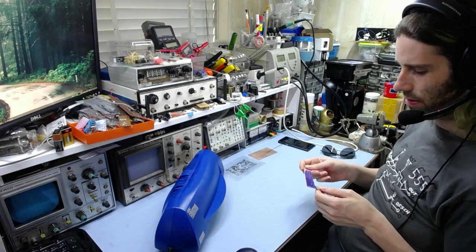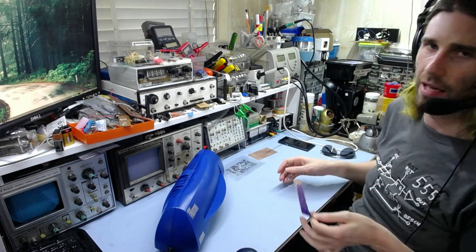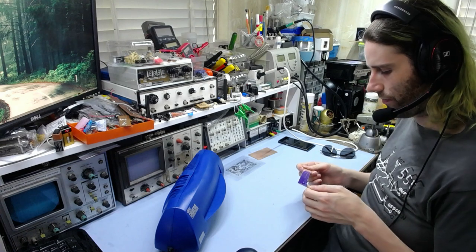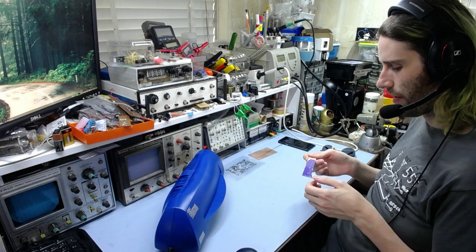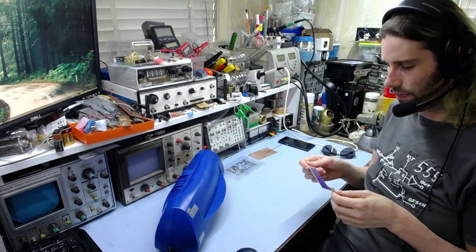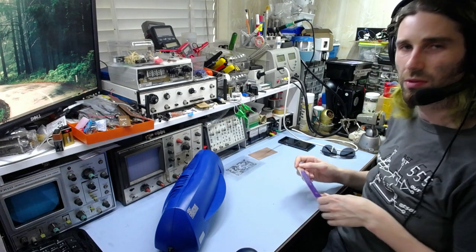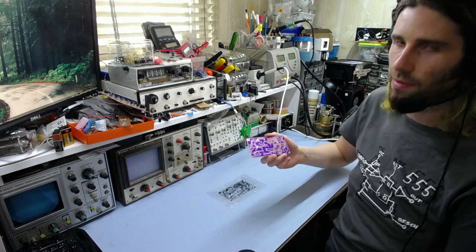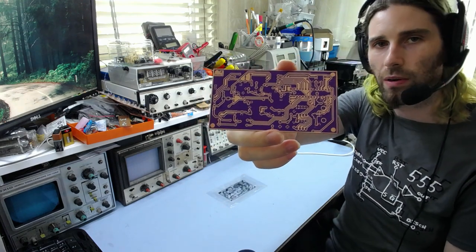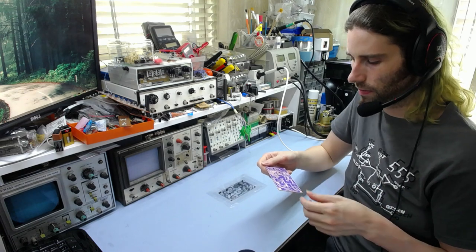I'll do that with this board and come back and tell you what happened. I'm not going to show the whole process again because I've got another video totally dedicated to making a board with this UV exposure method, so there's no point showing it here again. So that's the exposed and developed board — I need to etch it and everything, but there we go, it's come out quite well. That was about 12 minutes of exposure time.